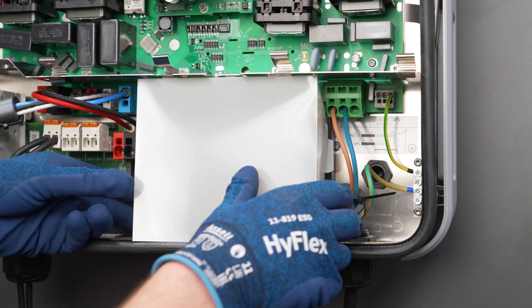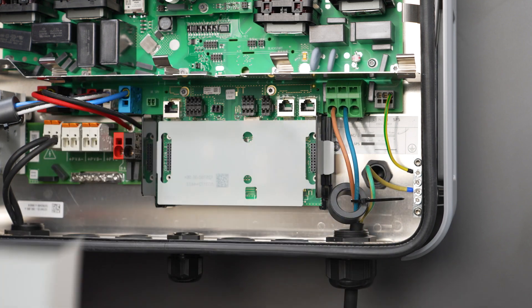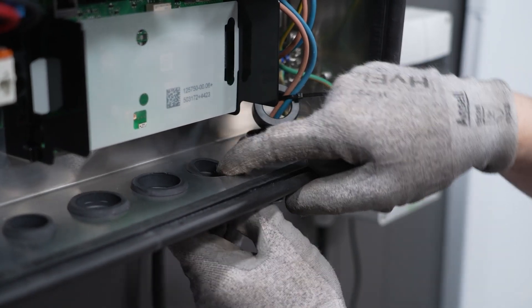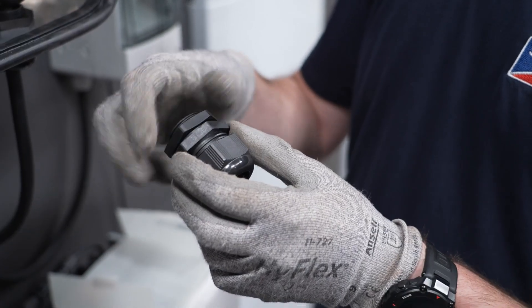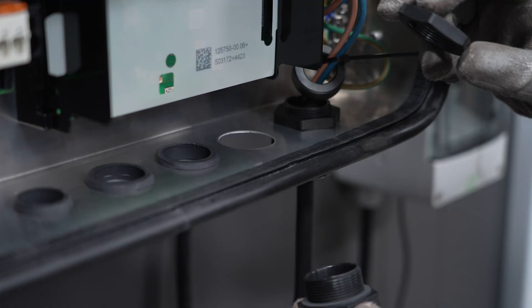You must remove the cover of the communication assembly before connecting the cables. The communication cable must be fed through the second enclosure opening from the right. To do this, remove the sealing plug, place the cable gland before the whole cable support sleeve in the enclosure opening and tighten it using the counter nut.